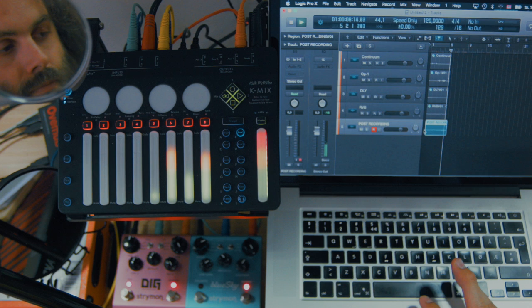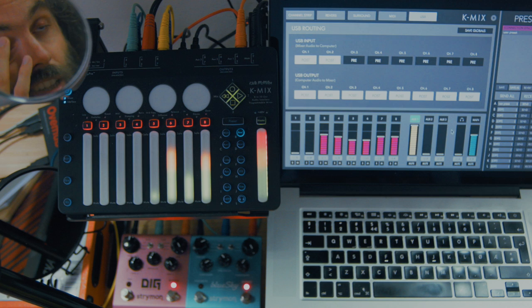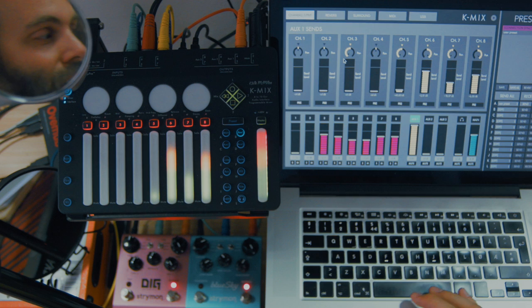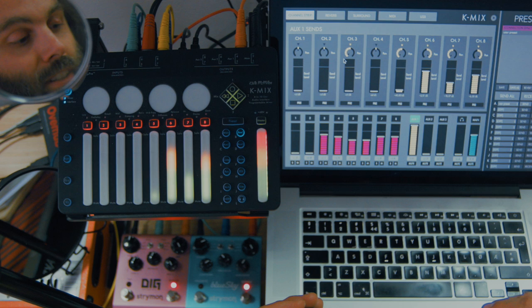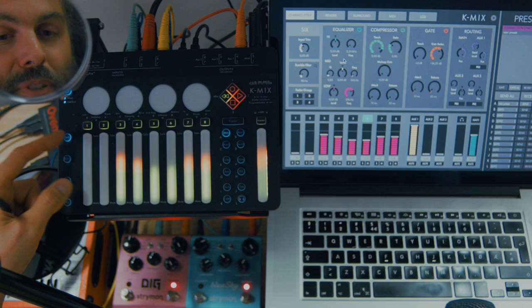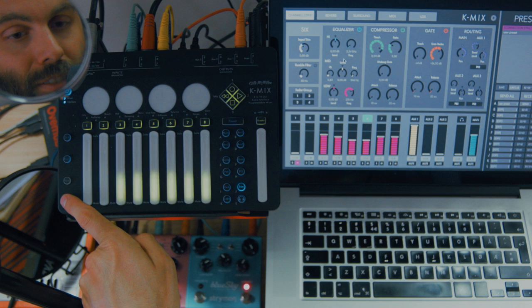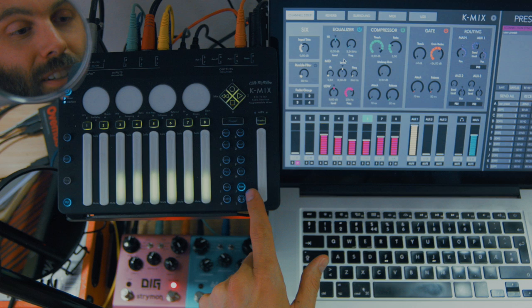Now this could be good if you want to record a whole mix, of course, and also if you want to record a certain track with a certain parameter hooked up to it. For instance, if I connect something like this, a Sennheiser E 935. Let's do that. Before you connect a microphone, make sure that the track is muted. You do that with shift and the lower half of this, and it turns red, because you never know what settings are on there. Okay, trim signal. I could even check the trim signals. Hello. Before I even turn on the main mix, before I even hear it, I could go to trim and see with the VU pressed, I could see the levels coming in there.